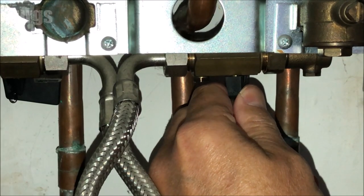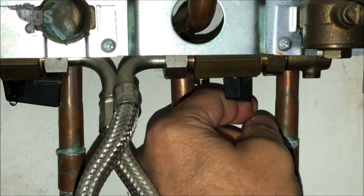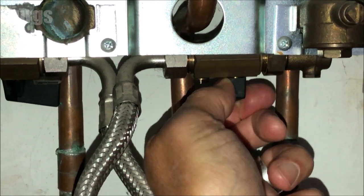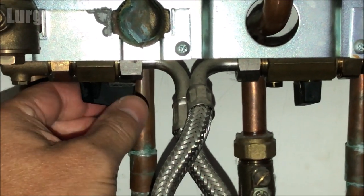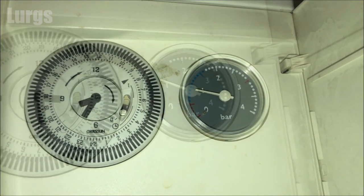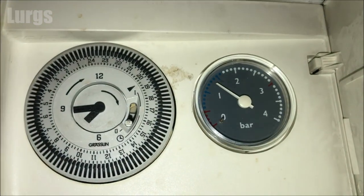Now let's go back down to the combi boiler and put a little bit more pressure in by turning the right hand tap slightly open again. As you're doing this you should see the pressure gauge start rising, and you want to get it to 1.5 bar. When it gets to 1.5 bar make sure you close down both taps — that's really important because you don't want to over-pressurize the system. This pressure gauge is slightly temperamental so I'm just going to give it a tap. This one is taking quite a while to top up, which is why you don't go mad when filling it up with water. It's slowly repressurizing until we get to 1.5 bar, which is absolutely perfect, and then your heating system should all be working properly.